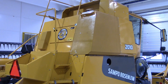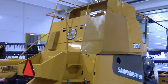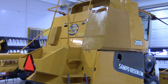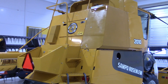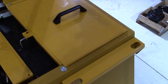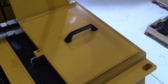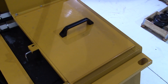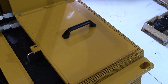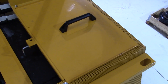There is a door for the engine bay, and inside we have a tier 5 engine for the EU area — a VM motor, 2.9 liter, 73 horsepower. Over the top of the fixed net you can find a service door; by removing that you can access the radiator area and clean the radiators if needed.